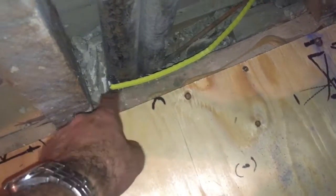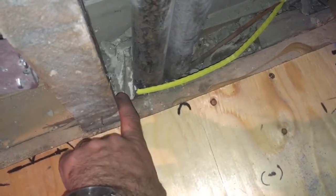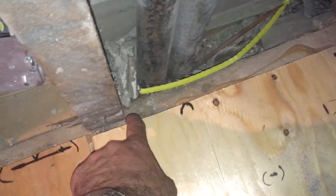So I started a 1/2 inch back from here and took that line right across, measuring the same distance off the studs to find where a 1/2 inch back sat, which put us at this line here, which is basically the back edge of the plywood. So we'll strap out these existing 2x4s with some new 2x4s so that we have a nice straight wall, straight and in line with the spot we need to be at the door frame, and then it'll also be square. The whole room will be squared off of that.